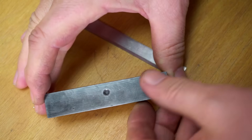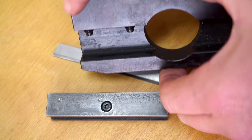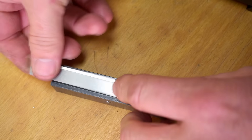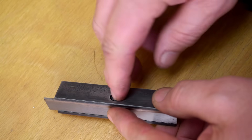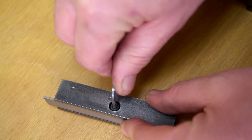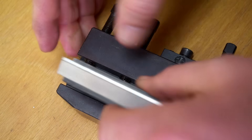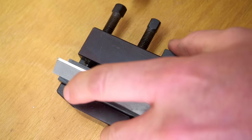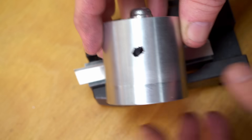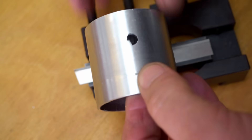Here's the finished part — I'm quite happy with it, although I've already picked up a bump from the screws on the tool holder, so I probably should have case-hardened it, but it'll work. That screw gives a bit of pre-clamping on the blade so it doesn't slide around while you're adjusting it in the main tool holder. It's still a bit flexible at the front but once you drop it in and crank it down hard, that stops the deflection. Before I can try that out, I still need to bore the pinholes on my pistons, so I'll do that first. The rings and the final dimension come after that.